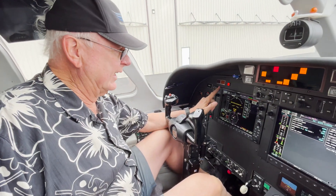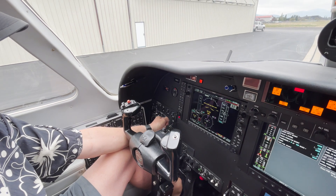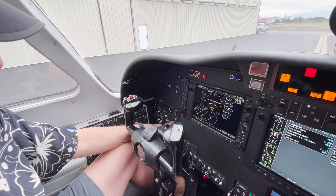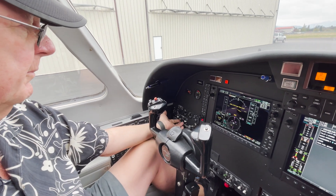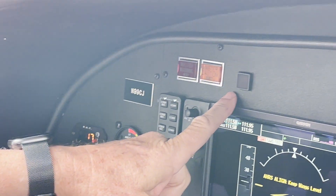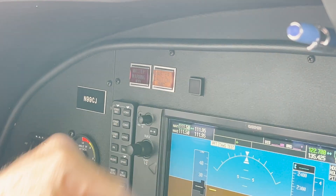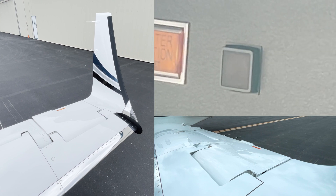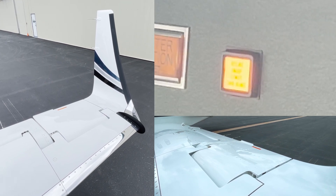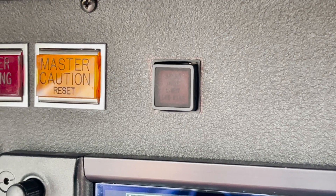So now we're doing the test of the ATLAS system in here. We turn on our battery and we'll turn on the avionics. Battery on — avionics are on. The light goes off — that's the ATLAS coming up. Then you press it three times within three seconds: one, two, three. And then it exercises the TACS by way of the TCUs — the TACS control unit. You can actually feel it; you probably can't hear it, but we can feel it. Okay, so the test is all done. That built-in test is complete.